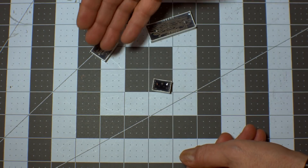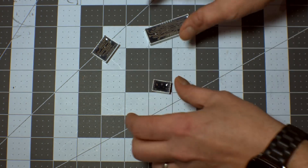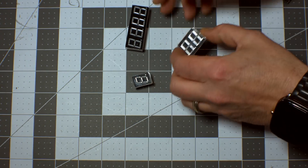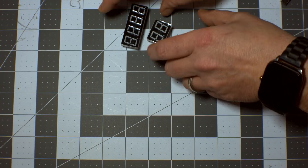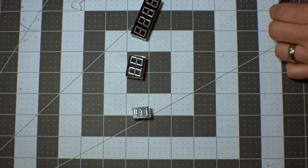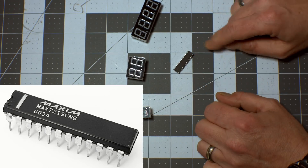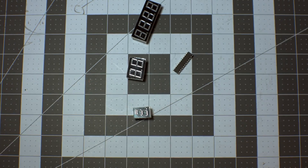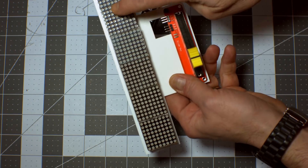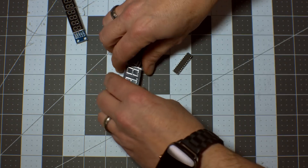If you flip the raw displays over there's nothing there — only a bunch of pins, no chip to control anything, so you have to build your own. If you have a project that requires one digit, two, or four in a specific position, that's the way to go. To control these with an Arduino, the one I use a lot is the MAX7219. This is an LED driver chip — it's found in those pre-made modules and also in LED matrix modules.